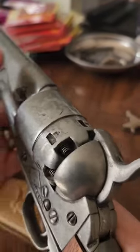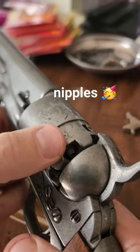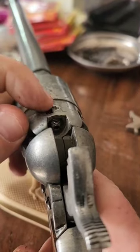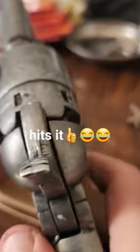There are other ways to do it. This involves taking the whole gun apart — I've drilled out the nipples, tapped the hole, and then put in set screws. These are made of hardened steel, so when you put a percussion cap on it and the hammer hits it, it'll pop a percussion cap.